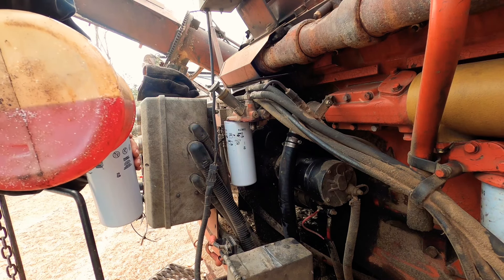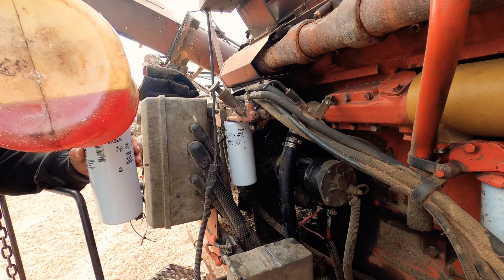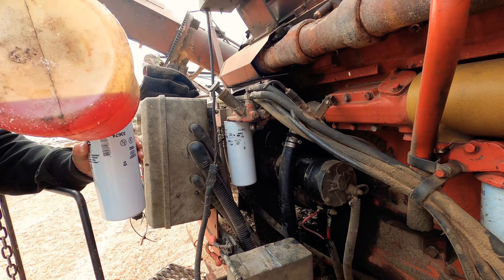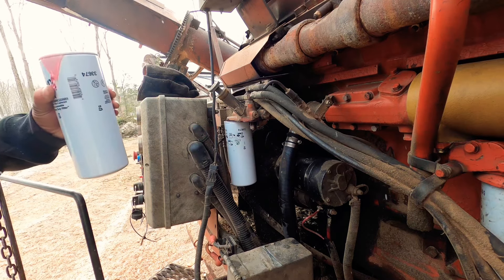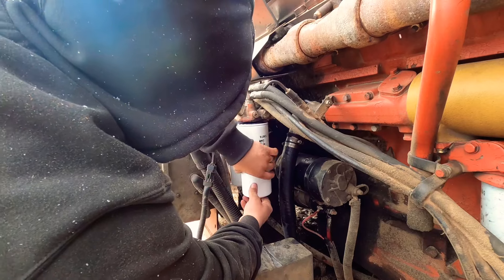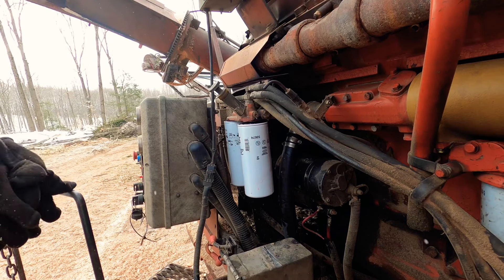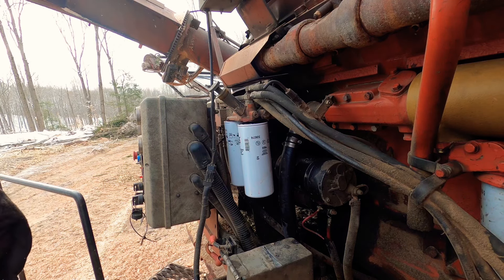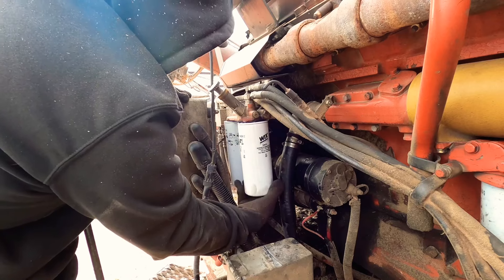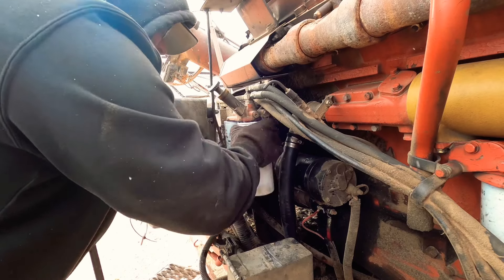On these chippers — this one's got a smaller tank, probably 300 gallons. The chipper at the shop runs 500, and I bet the 2355s run 400. You can add 911 and anti-gel all you want, but it ain't gonna be enough to do anything. You gotta do this — you can't add enough stuff to that to get it to work. Doing it like this, you get a break and everything's warm, it's not too bad. Preventative. We've had them where they don't start — the fuel doesn't get hot enough.